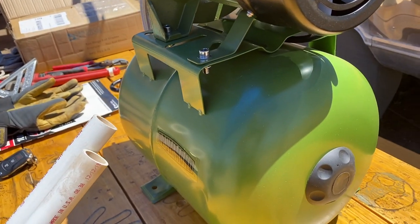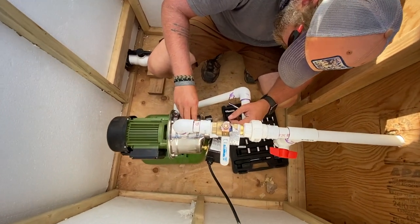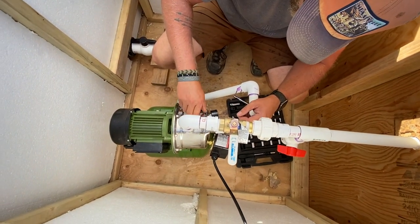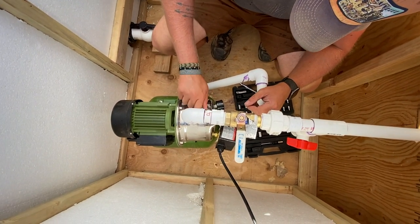It's like a one-horsepower shallow well pump. We got it all hooked up, but we had so much trouble with leaks because it had a lot of threaded fittings and the water pressure was really, really high. So we plumbed and re-plumbed, and we learned so much about plumbing and how you need to give yourself an out when you're plumbing.